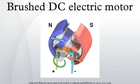This can also be a problem with railway motors in the event of a loss of adhesion since, unless quickly brought under control, the motors can reach speeds far higher than they would do under normal circumstances. This can not only cause problems for the motors themselves and the gears, but due to the differential speed between the rails and the wheels it can also cause serious damage to the rails and wheel treads as they heat